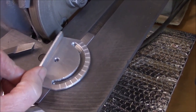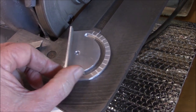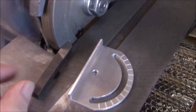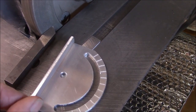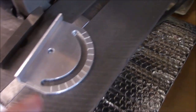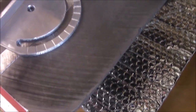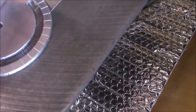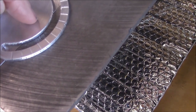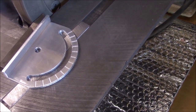We've got the rotary table set up. I want to make a few more of these miter gauges for different setups. This one covers most things, but when you're trying to do a real shallow side cut, this gauge is pretty limited. With the pivot being in the center, you're going to be way away from the cutting wheel. So I want to make another one that will set up closer in — probably put a pivot hole there but make the radius slots look a little different since they'll be based off a different location. This one's probably going to be a little wider too.